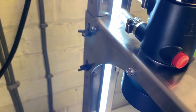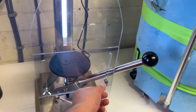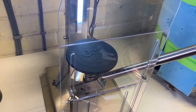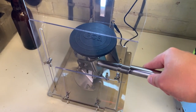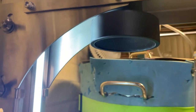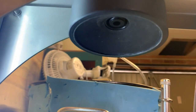The height of the bottle stand can be adjusted by removing the two bolts at the back by way of the wing nuts. On the front there's a clear perspex safety guard which can be adjusted for height to match the stand itself. This will obviously protect the user in the event of any bottles bursting, which seems like a sensible idea when packaging a large volume of glass bottles under pressure. The bottles are held in place by a spring-loaded platform at the base, which you lower by pressing down on the lever. This pushes the bottle upwards into a rubber cup which houses the nozzle for the iTap. The concave design on the underside should make it compatible with almost any bottleneck — whether that be crown caps, flip tops, corks, or even screw top growlers.